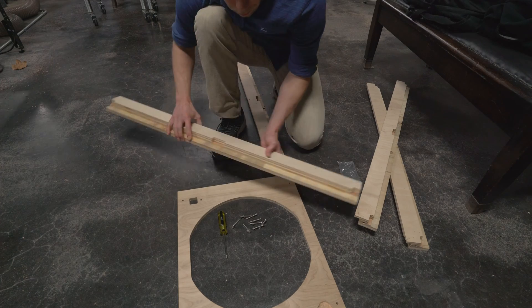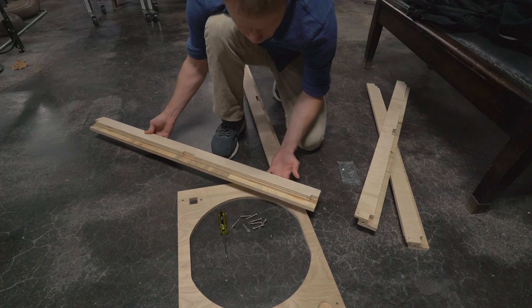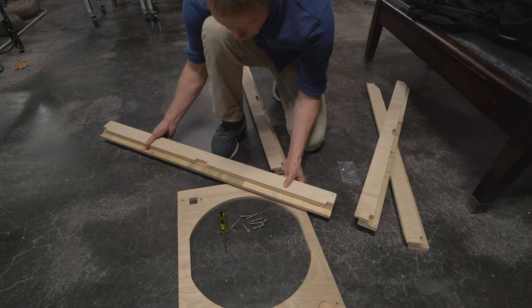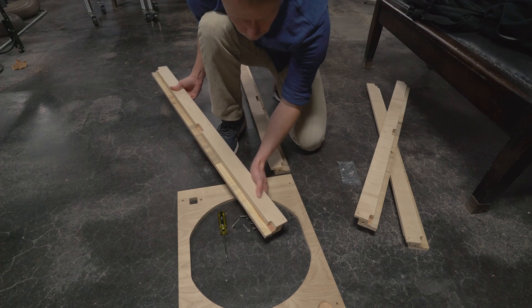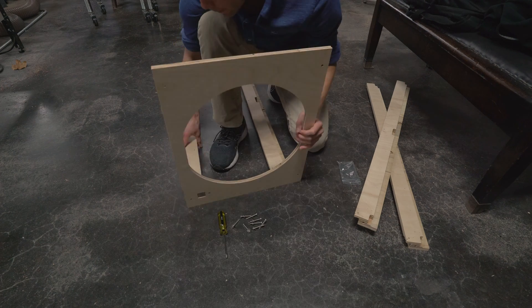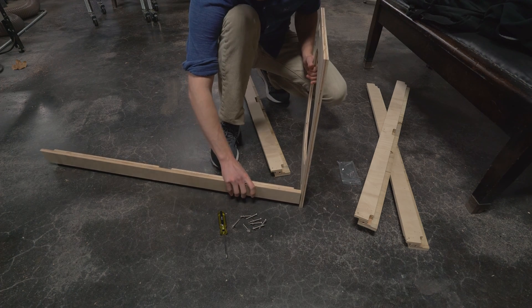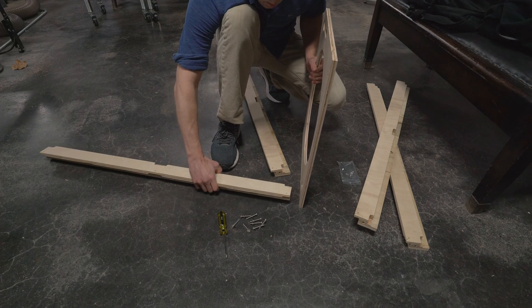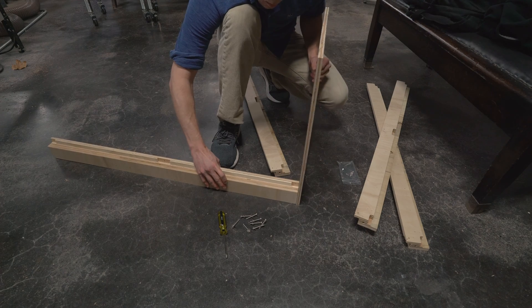Now working from a table or on the floor, you will want to arrange the top, bottom, and four legs. The direction of the leg is important. On one side of the leg, there will be some small, visible nail heads. These will point to the inside of the box. If the outside corner of the leg is open, like you see here, the leg needs to be flipped over. The outer corner of the leg should be in line with the corner of the top, like this.